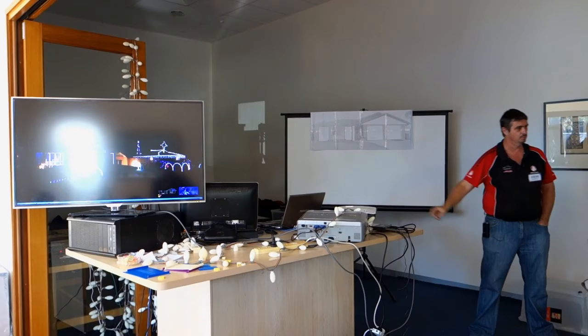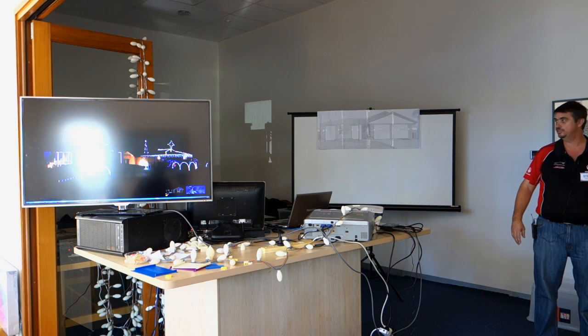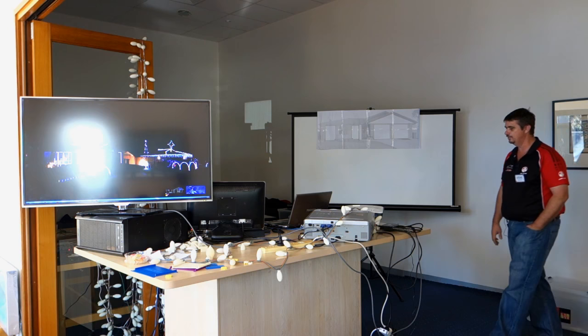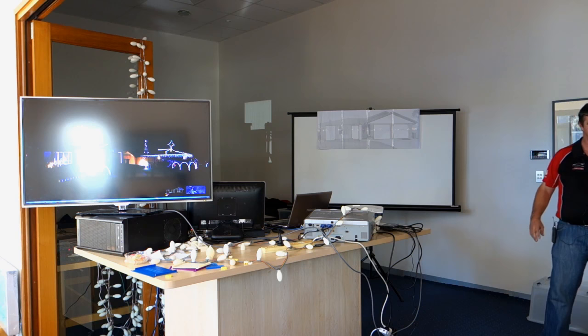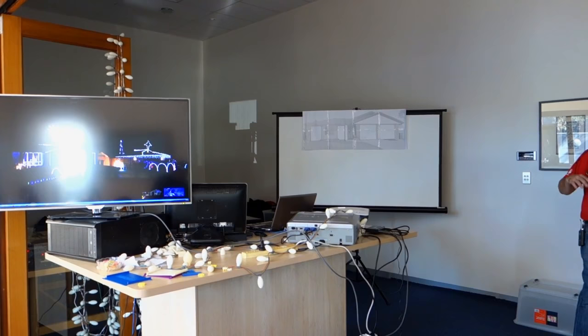One's probably a standard throw, equivalent to a home theater projection - if you had a 100-inch screen, you'd sit at about four and a half meters back to project that whole image. This one here is a short throw projector. Same size image, but closer. You can see it's about a quarter of the distance ahead of the other projector to get the rough size of the screen. When you're multiplying that across a house, it's the difference between the projector being in your yard and across the road.